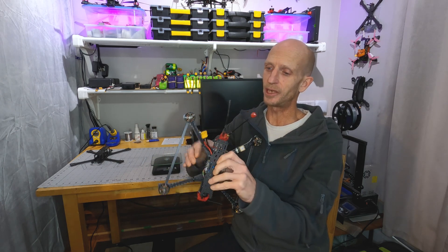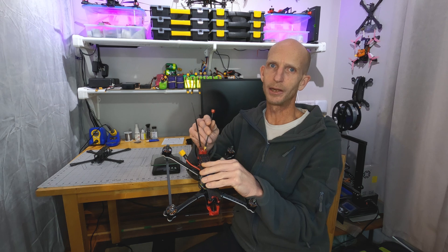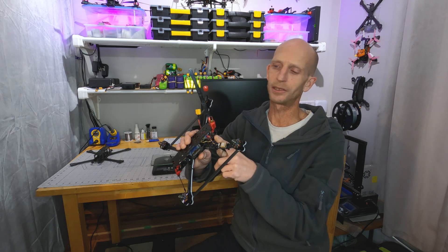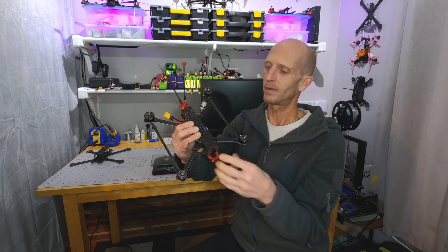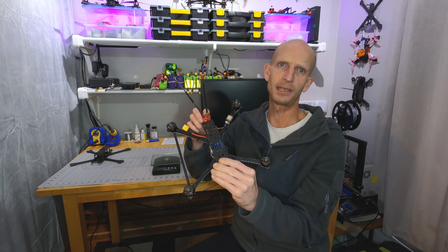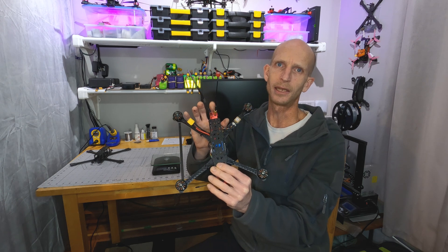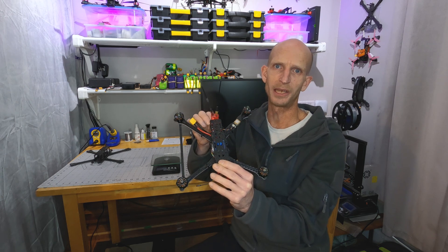One of the things I'd still like to change is the antenna. I wish I could get a TruRC Singularity — a nice long one that goes down to an MMCX — but all the ones I've found with MMCX connectors aren't long enough to plug into the VTX, come up through a mount, and still get good reach above the battery on the quad. The SMA connector is about two or three grams per side, so I could probably save six or seven grams by switching to an antenna that goes MMCX straight to the antenna without needing an SMA extension.